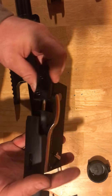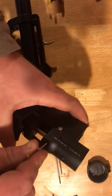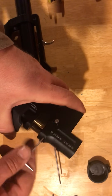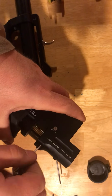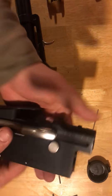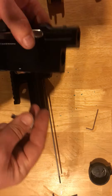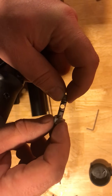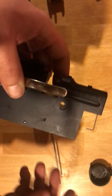We are going to move on to the action itself. This is going to be your power adjuster. There is a small hole just offset of the breech screw. What you will do is loosen that up — there is a small screw there. Drop it into your little container. Turn it over, give it a little tap. You are going to have a spring and a pin. These are going to be what hold the power adjuster in place. Now this power adjuster has been opened up to three-sixteenths of an inch — it's been drilled out to allow more airflow. There's a little pin on the side that lines up with a little groove on the receiver itself, and that's what keeps it on high to low.